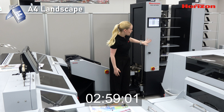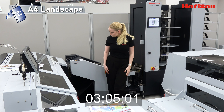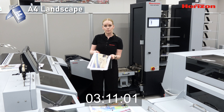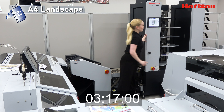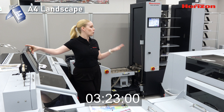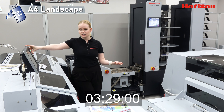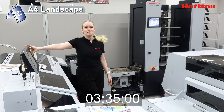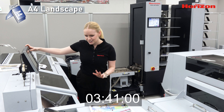Our towers now — tower one moved down, tower two is moving up. It's going to run that calibration feed. All of our pages are here, so let's just make sure the camera read all the sheets. They look great. Let's run our test booklet. Again, this is going to follow the same order of operations: collator, accumulator, saddle stitcher, and trimmer. And honestly, we can do three in six minutes — so quick, easy, simple, automated. Love it. No more saddle stitching by hand. Quick pause at our saddle stitcher — but everything looks good.